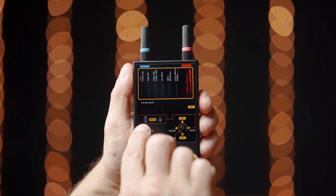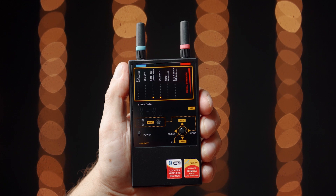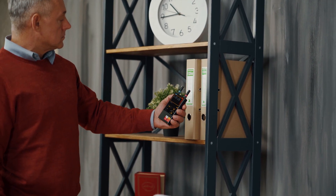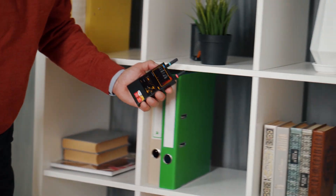Choose the desired operation mode. Silent is the default mode which is automatically selected after turning the unit on. The listen mode is more convenient for locating and inspecting the RF source, as the operator can learn about the source by hearing a demodulated signal.